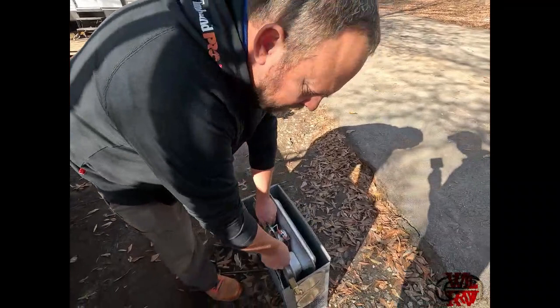So let's go back inside, put it back in again, and surely it'll go now. Victory will be ours. We found some stink bugs and some Japanese beetles. We cleaned out a little bit of that. Went and put the furnace back in, and the furnace would blow and run great, but it wouldn't ignite. So now we got a combustion issue. So we had to take the furnace back out of the cabinetry, which we didn't show you, and took it back out to the truck, which we did show you, and cleaned out the burn chamber real good.